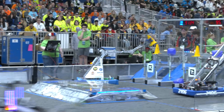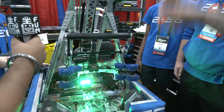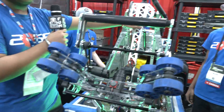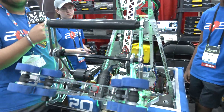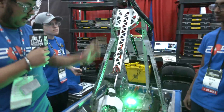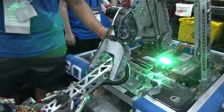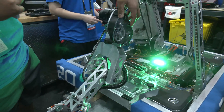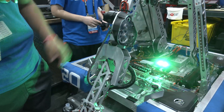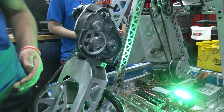Let's go into the arm a bit more. A lot of the arm geometry and design, and the way the sprocket and everything links together, is heavily based off our 2011 robot. It has a very similar three-tube design with a really big sprocket. We have one tube here with the three-tube geometry and another sprocket here. You can also see our gearboxes, which have these nice 3D printed covers — all custom gearboxes made with our CNC mill. These 3D printed covers really prevent any grease from flying out or anything falling in.